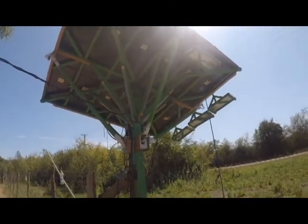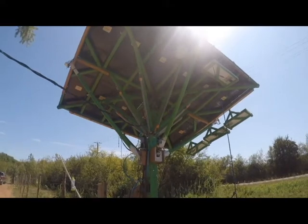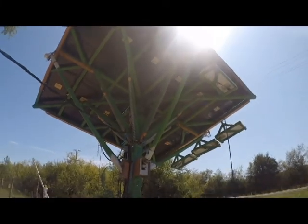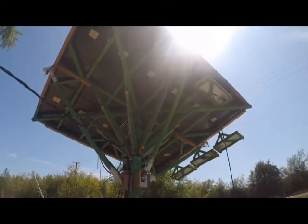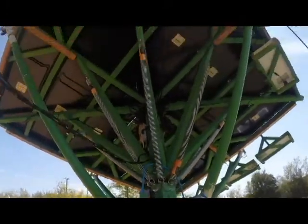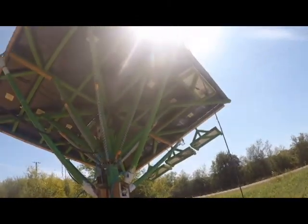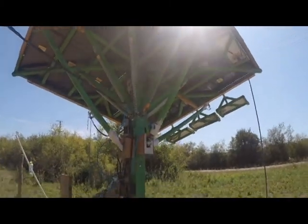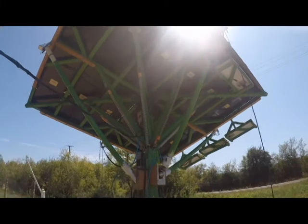I thought I could keep the panel on top of the ball with a spring. I bought small door springs but they didn't work well, so I got the biggest ones they had and put them on at 20 inches, but it would flop around quite a bit. I kept raising them — I'm scared of them because if they come loose they'll blow right through a solar panel. I raised them up to 30 inches and they work very well, keeping it so it can never go down to the ground even if the positioning tubes were not installed.